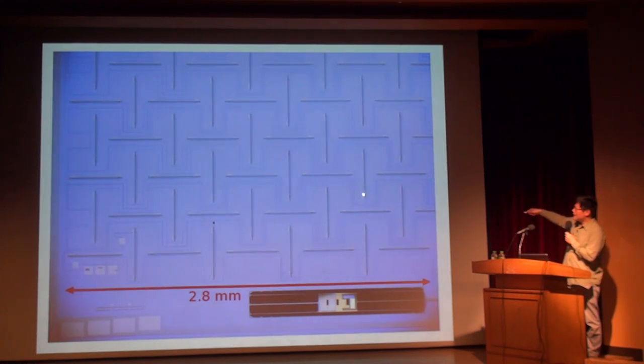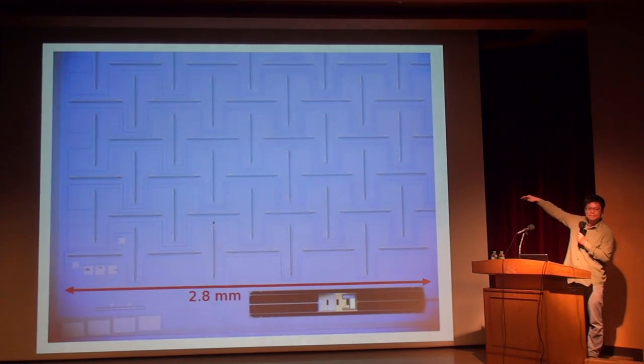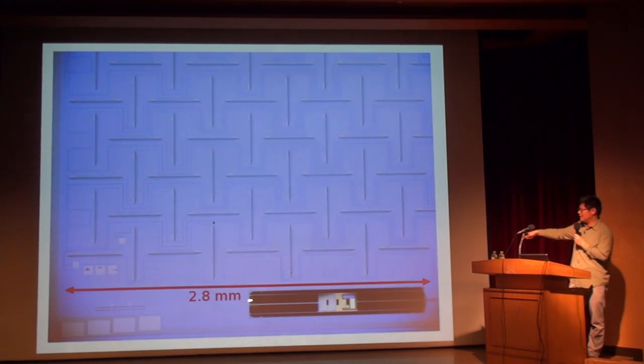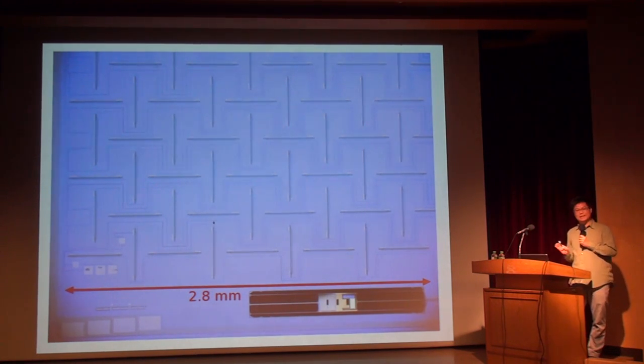And the voltage difference generated by incident microwave was collected by this meandering summing tree coherently and then sent to an on-chip filter. And then that power is dumped onto a thermally isolated thermometer. Okay, so these are thin legs. And the bolometer, or the thermometer, heats up as you scan back and forth.